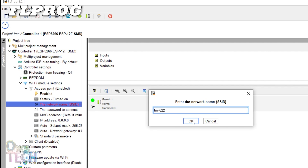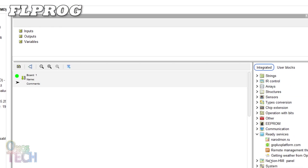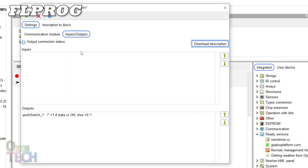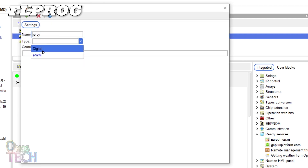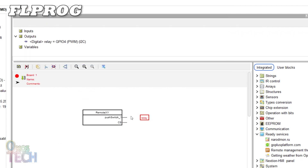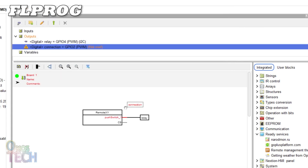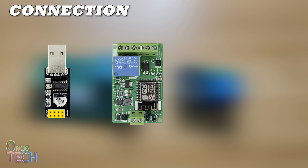Add a password if required, and input an IP address of 192.168.0.1. Insert the RemoteXY block and paste the code from the web interface here. Also enable the output connection status. Add two output tags: one for the relay as GPIO4 connected to the push switch, and the other for mobile connection status.